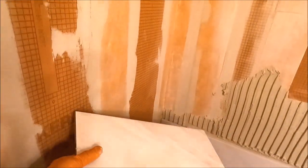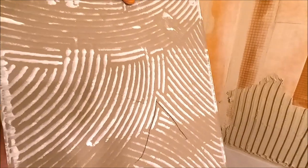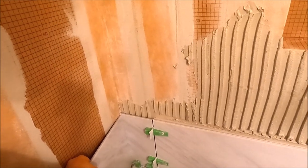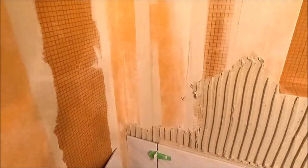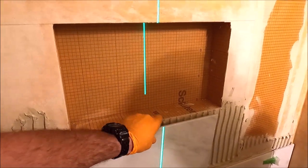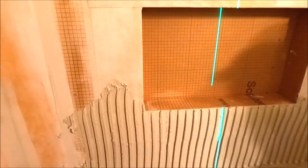What we're doing is real simple — we like to wrap the walls with the same tile. So this first and second row we will install the cutoffs. You simply mark the back left two, so this will connect the veins. It is the same tile — it'll wrap. If you can pull this off, highly recommend it; it looks really nice, clean, and professional. And as usual, we have a full tile right at the top of the niche.